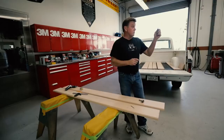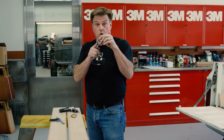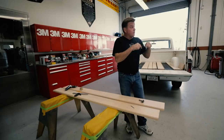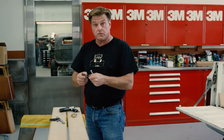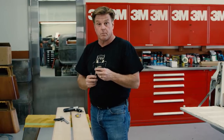The washer that holds each of the bolts that hold the bed down has a hole that's off-center — three-sixteenths of an inch off-center of the washer itself. So when I mark all the holes in the wood, I put two indications there: one directly in line back three-sixteenths of an inch. One is for the bolt and one is the center of the washer. I'll drill down so the washer sits flush, the bolt goes all the way through, and that little offset keeps the bolt from spinning when we tighten it from the bottom.